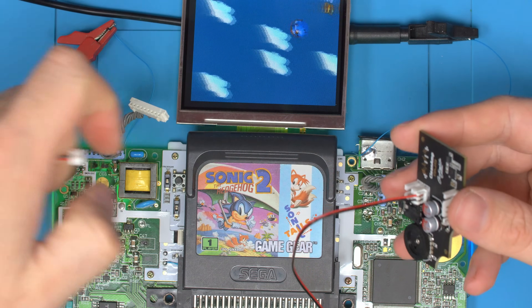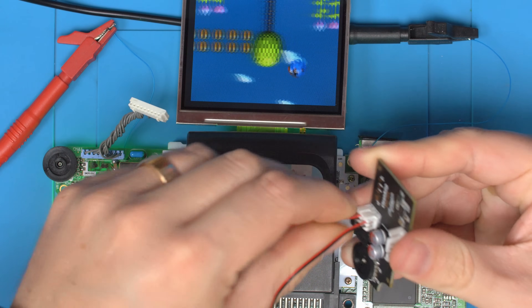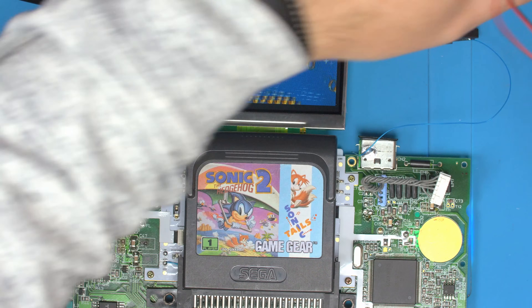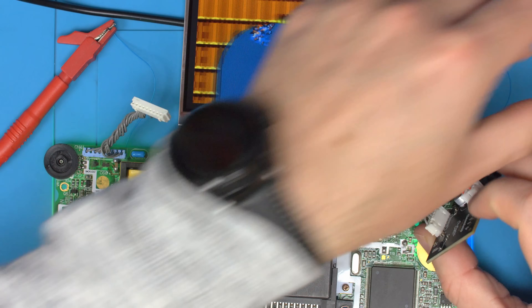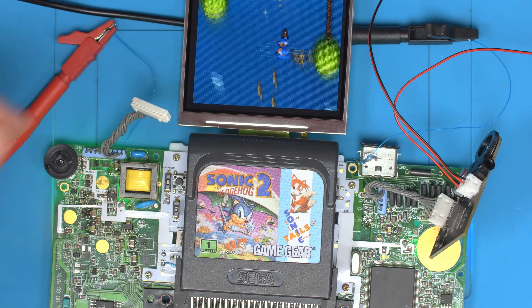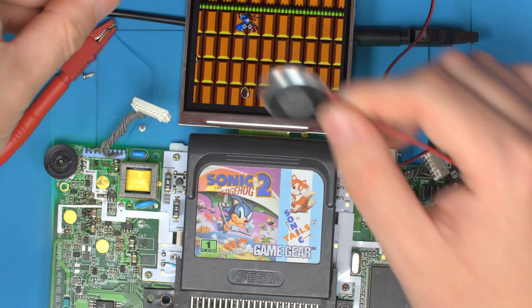Let's see if the Clean Amp Duo works. I'll plug in the two 4-ohm speakers — and we'll sell these speakers on the store along with the release of this product, because you will need 4 ohm. If you use 8 ohm it's going to be a lot quieter. It shouldn't be as loud as the single because I've made it a lot more about quality than sheer volume, but it'll be more than loud enough for anything you'll ever need.